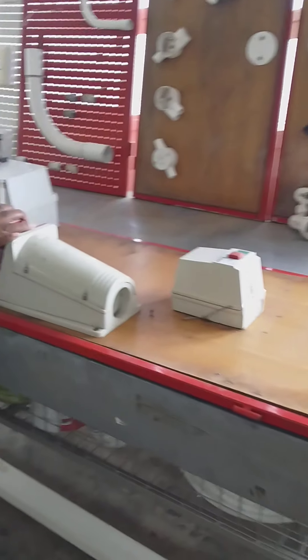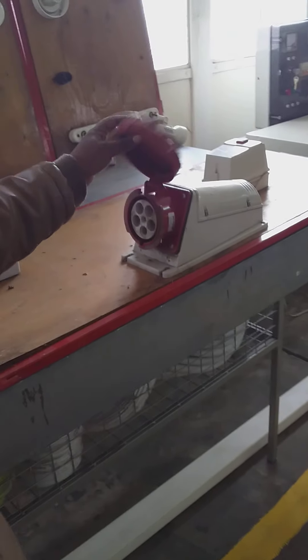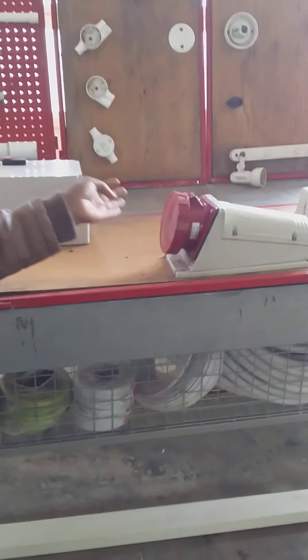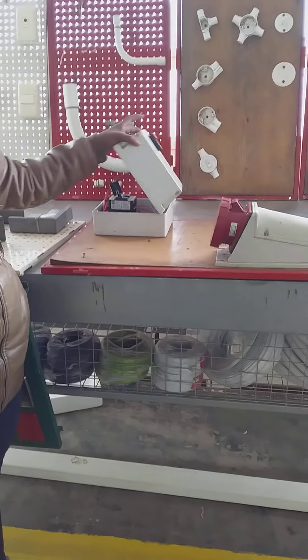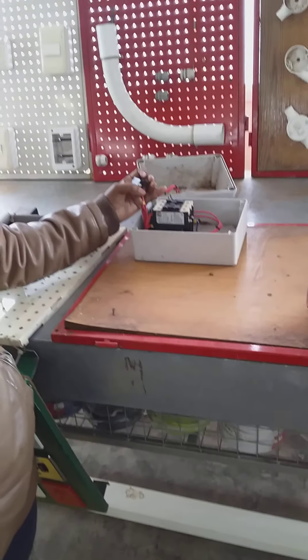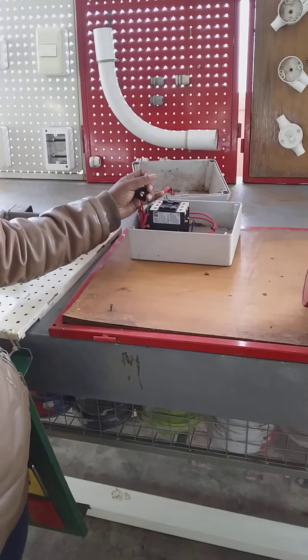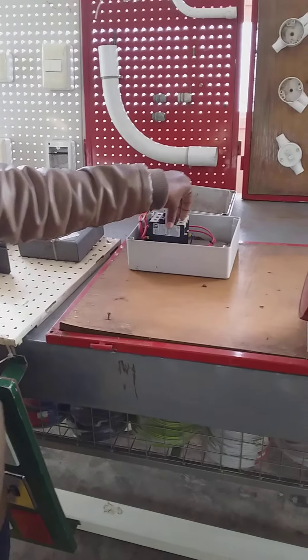These are our industrial socket outlets, which can help us with three-phase systems, but they come in different categories. These ones are pre-made starters — we can have direct online starters, which we usually use for our pumps. It's ready-made, and students must know how to do fault-finding on these.